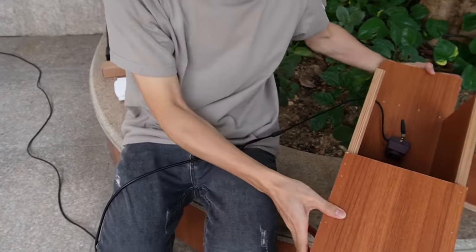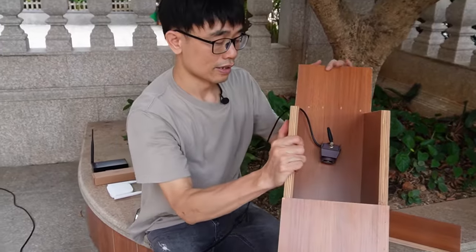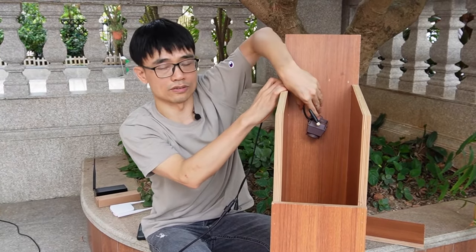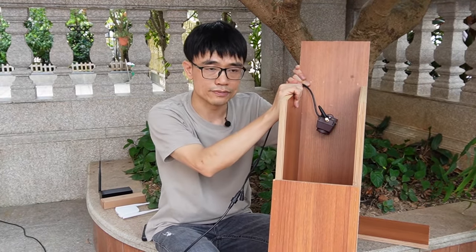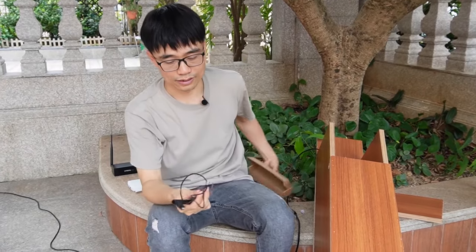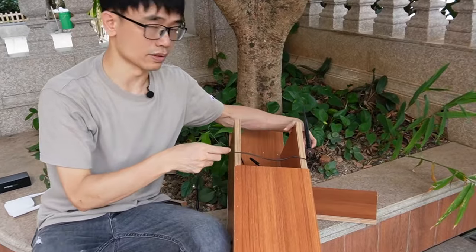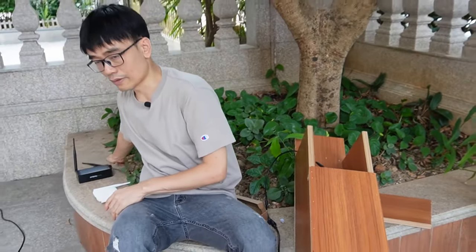And here we can still see the live video from the camera. There are several things to pay attention to — the box can be quite aggressive on cables. It's better to use some conduit to route the cable and protect it. We've received reports about boxes cutting cables and damaging cameras. The second thing is about the antenna — this is the L-shaped antenna. You can also use this larger antenna, though it doesn't come with the package. You can mount the antenna on one side of the box and connect it to the camera — it will provide much stronger Wi-Fi coverage.